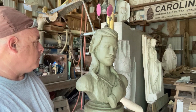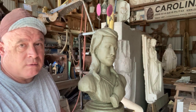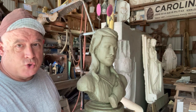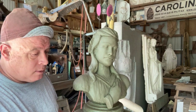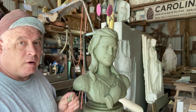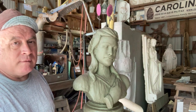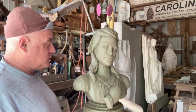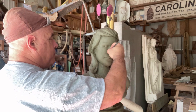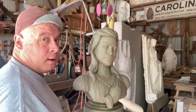And I'll risk using old silicone, like it's been in the office or whatever. If you buy silicone, leave it out and it freezes, it's junk. Okay, if you put it in your building and your building can go below 0 or water freezes, it's junk. It'll never cure right. Like I said, I've had molds where they failed and I had to peel all the old goopy, nasty silicone off. I'm going to put perfect silicone I know is good on first. And then after that, if I want to try some other stuff, I may give it a try, but I try to not have a lot that sits around for an extended period of time, so that when I run out, I just wait, and then I go to the store and I buy brand new silicone so it's nice and fresh. And so I'm going to work on putting this together, and we'll be back in a bit.